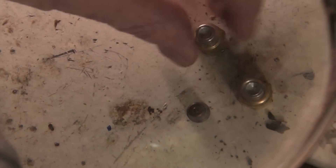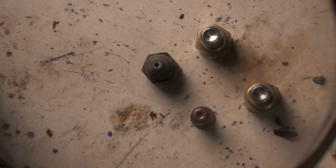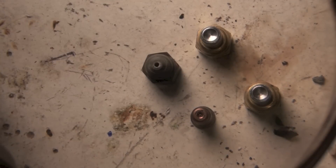I've magnified quite a bit here — these are very, very small holes. You can't even put a pin in them. They're not designed to be repaired; they're designed to be thrown away. So if you get one that's plugged, there's really not much you can do — you just have to get another one. Often you have to buy the whole pilot assembly just to get it. Anyway, that's the pilot orifices for what it's worth.